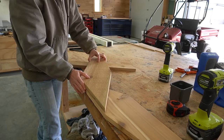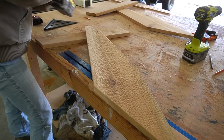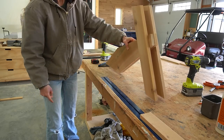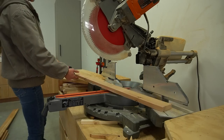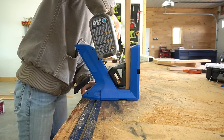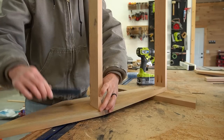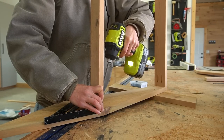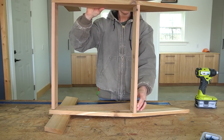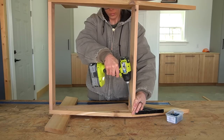I repeated this for the other side of the chair, making sure to mirror them so the front leg is on the opposite side of the back leg. That way when they come together, the back legs are on the inside, which is where the seat slats will rest later. I cut two 1x3s to run between the two leg assemblies — one for the front and one for the back. I used pocket holes and screws to install these, but regular exterior wood screws would work as well. I installed one 1x3 flush along the front edge of the leg assembly, then installed the second so that it was square to the top back edge of the back legs.